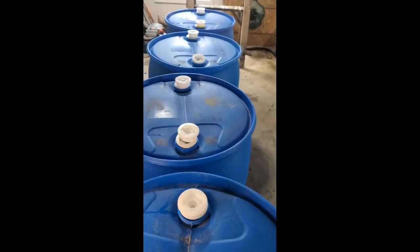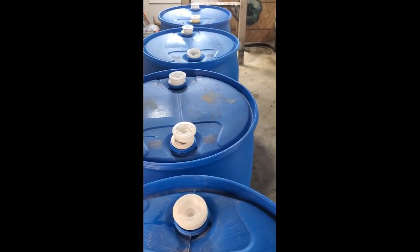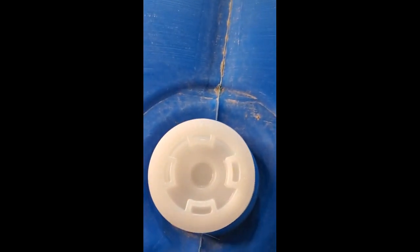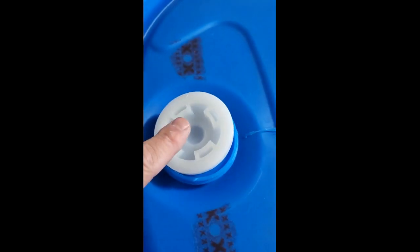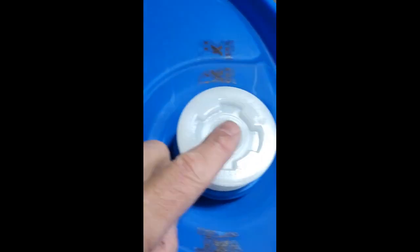And the opposite side of this system, way down there, that's going to be where my spigot is, where my outflow comes from. So what I'm planning to do then is my bunghole farthest away is closed, and then T-in, closed, then T-in, closed, then T-in, closed, then T-in. So every other is a T-in, the other bunghole is just closed and sealed forever.